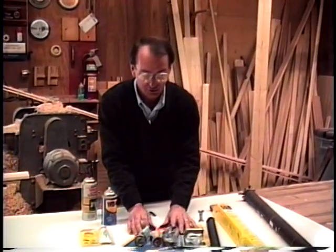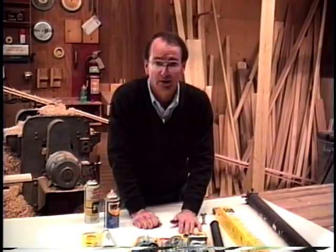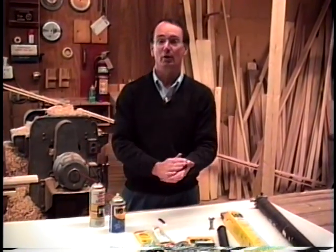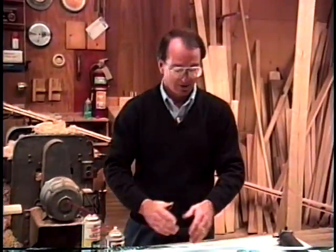And we're going to take a hinge off, we're going to put a roller in, we're going to lubricate the door, and we're also going to lubricate it with not motor oil. This is one of the most difficult things. People will come in the wintertime especially on automatic garage door openers, and when it gets real cold, that door opener will just chatter. It'll hardly want to lift the door. They think something's wrong with the operator. And usually the operator is just fine. And if you talk with them a little bit, they say, you know, I just oiled it up. I don't know why it's running.